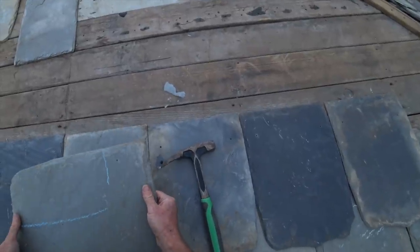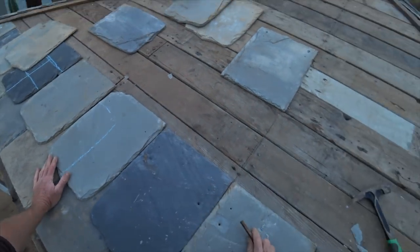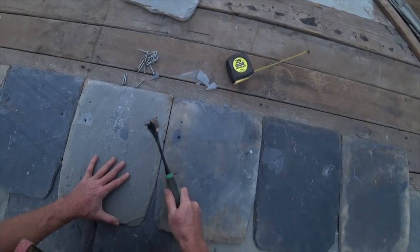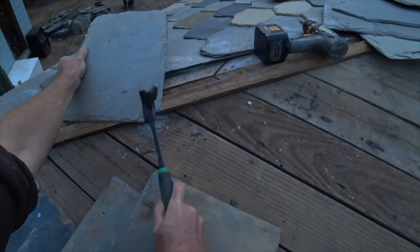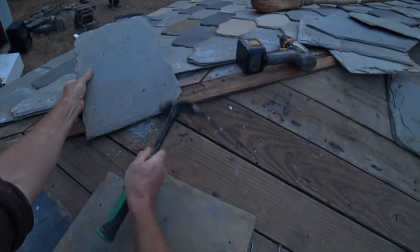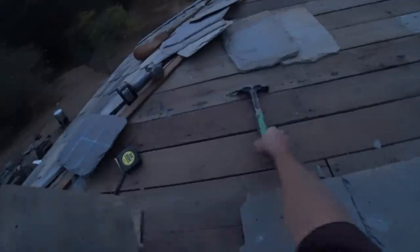That's the wobbly one - I want to cut this corner off. It's so thick I think I'm gonna take it down and cut it. You can see this is still wobbling - the slate is really warped, it's cupped like this. Basically this is gonna have a quarter inch gap under it if I use it, so I'm not gonna use it. This other slate's wobbly on that corner so we're gonna do away with that corner. Better - let's just take a little bit off. Much better. Let's nail them.